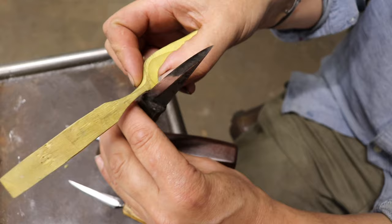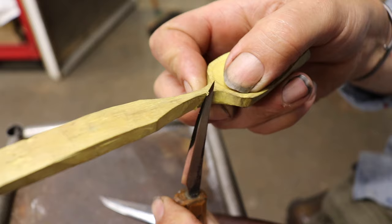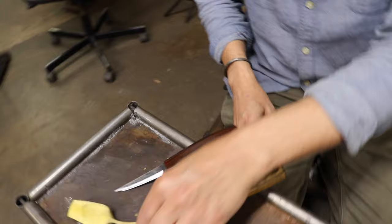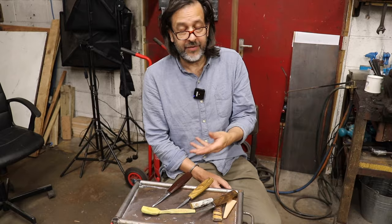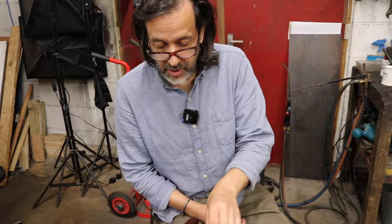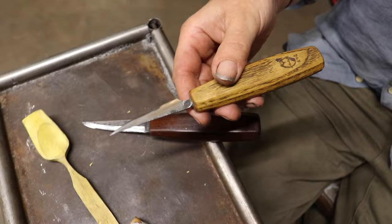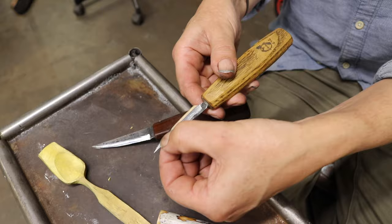You see, it can't engage smoothly, whereas if we look at it like this, a short bevel will turn round and cut round. So it allows you to make cuts that you can't do with a Sloyd knife, and it will turn in a cut. That's the idea. Dave calls it something else, obviously. I call it a turning Sloyd because it will turn in a cut. It's nothing to do with wood turning. So that's the main thing. There's geometry involved, but we'll talk a bit more about how we arrive at the short bevel when I do the grinding, because that's what the grinding episode is about, really. But it's to do with the short bevel. That's what makes it a turning Sloyd.